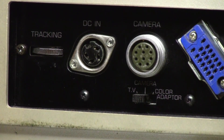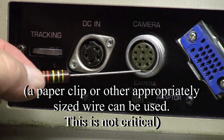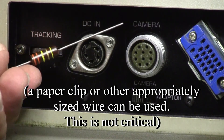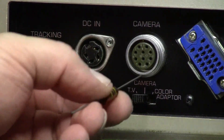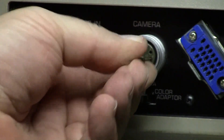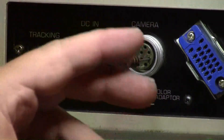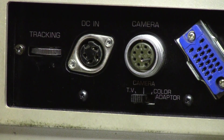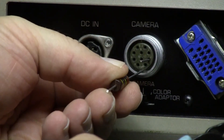Now, to access the inner electrical contacts you use a good old 2-watt resistor. You can get these at a surplus store or any electronics supply house, or just cut them out of an old TV or radio. The reason I recommend these is the wire is exactly the right size to plug into that jack perfectly. Plug it in and clip it off leaving yourself about a half an inch of wire. And do this again for the next pin.